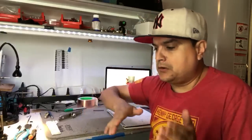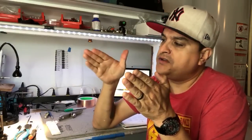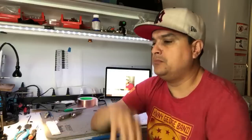If you put two single coils in series, they can be noisier if they are phased the same way. So if you have clockwise north up, and you put them in series, like a humbucker, they'll be twice as noisy as one pickup. So if you have a bunch of pickups in a drawer and you put them in a Strat, and it's really noisy in one position, chances are it's because you have matching polarity and they're doubling up their noise.